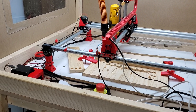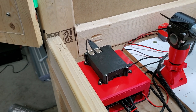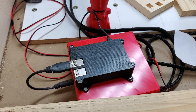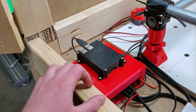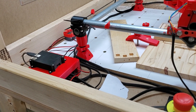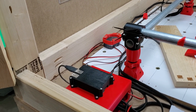This is an enclosure I designed myself for the machine. On top of it I have a Raspberry Pi — I'm running Octoprint on the Raspberry Pi and controlling the Rambo board with Octoprint. I'm pretty familiar with Octoprint from my 3D printers, so I figured it was only fitting to control the CNC with it too. I'm used to the workflow, and I also don't have a laptop tied up to the machine, so I don't have to worry about Windows updates screwing up an hour-long cut or the laptop going to sleep.